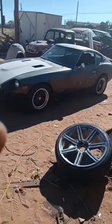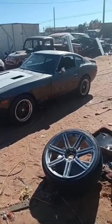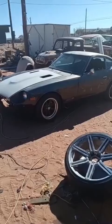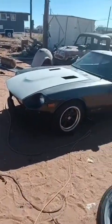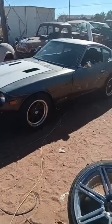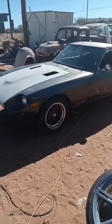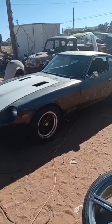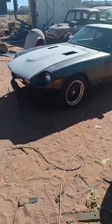It developed an idling issue, and it's because the carburetor's dirty, because the carburetor got wet. The previous person that had it, it's a brand new carburetor, but the box is all wet, and the inside's all corroded, and it started idling funny. It wouldn't be the idle mixture screws, because it's just intermittent. Let's see if I can take this off and try to clean it. Brand new, I wouldn't want to mess with it.